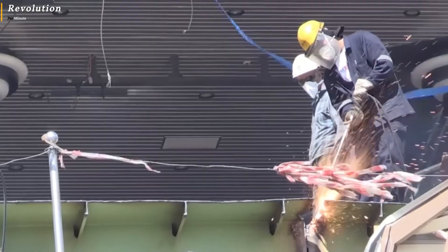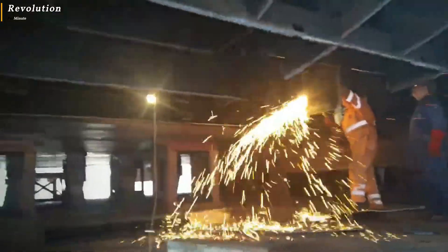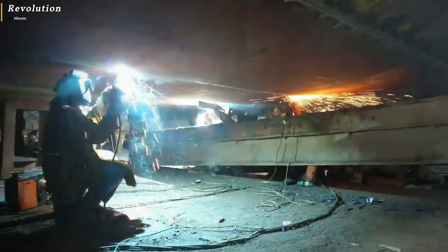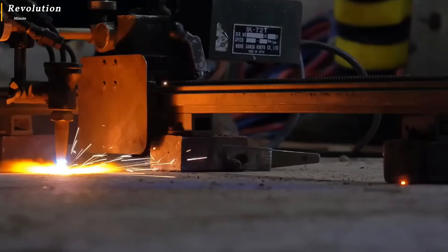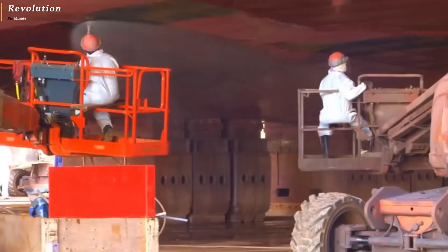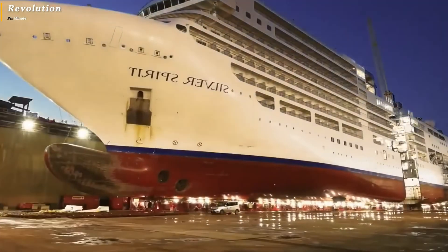After the inspection process, the next step is cutting. Shipbuilders often use an oxy-acetylene torch or laser to cut the hull, ensuring that the cutting tool follows marked lines. Oxy-acetylene torches use oxygen and acetylene gas to produce a very hot flame capable of cutting through steel. For greater accuracy, cutting robots are also used to ensure each cut conforms to a predetermined line. Cutting a large ship takes considerable time, often weeks to months, depending on size and complexity.